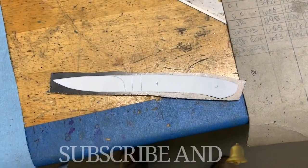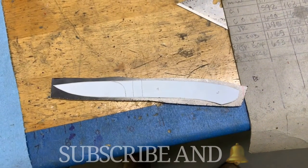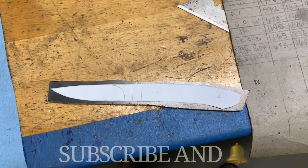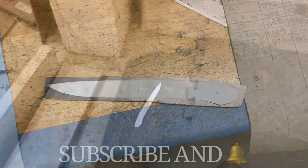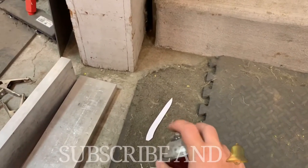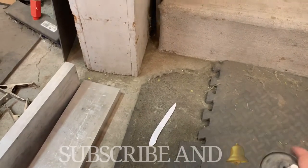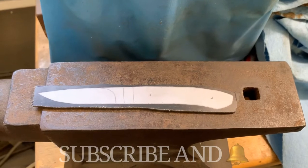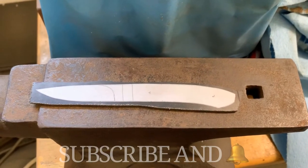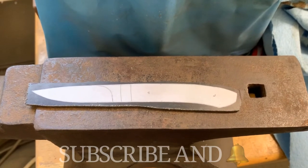Now that I have the piece of mild steel cut to a smaller piece, I will apply spray adhesive to the back of the paper pattern and then attach the pattern to the piece of metal. Now that the paper pattern has been glued to the steel I'll make my metal pattern out of, I will lightly scribe around the outside, and I will center punch where I will put my bolt holes.